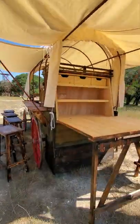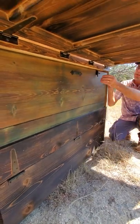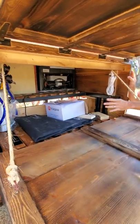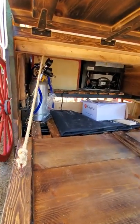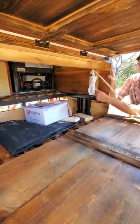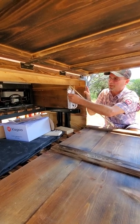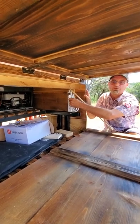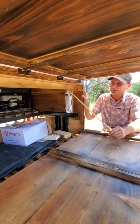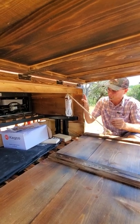On the boot box, we have additional storage for your pots and pans — it has a latch. That comes down for additional storage. We've got a keg blanket and our CO2 system for this client. We have a power strip here; it's labeled and it is not GFCI protected. Code requires most newer homes to have all outdoor outlets GFCI protected, so just make sure you plug it into a GFCI protected outlet.